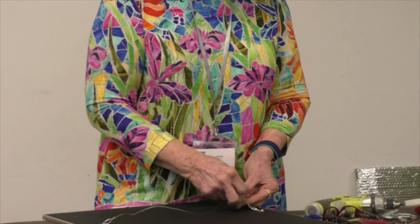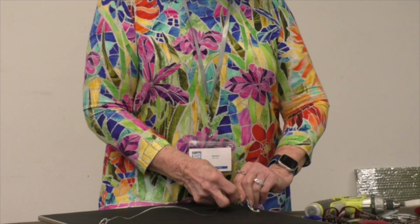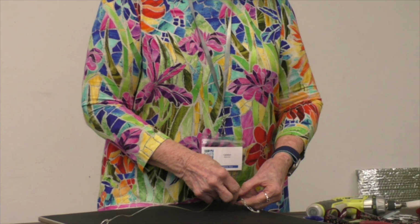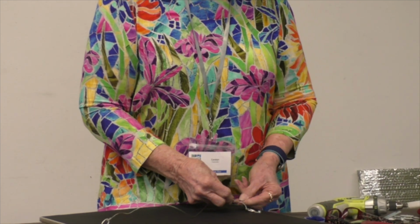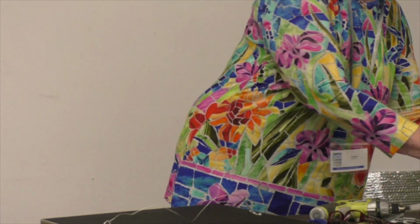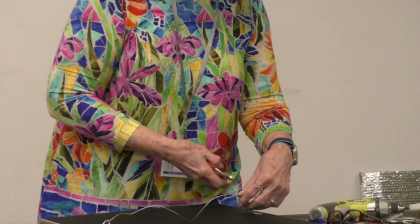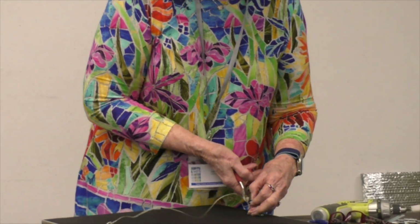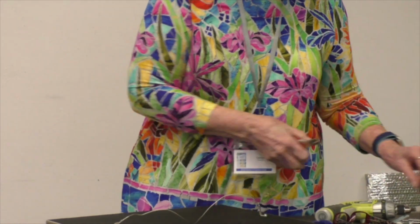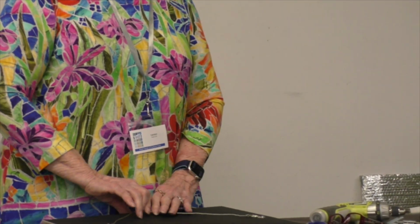If you got much to do, you spend all your time tying those little knots. You can take the same thing, run your wire through, wrap it around, and make at least 4 to 6 wraps. And then if you tape that, you get no problem because there's no tension on the circle. This way it takes all the tension off of the wire itself, so it has no reason to unwrap. You don't have to tape it or anything. I haven't ever done the knot, but I always would run the wire back through the ring twice. I go through the other ring twice too. There's all kinds of ways you can do it. You just wanna be sure it doesn't fall.